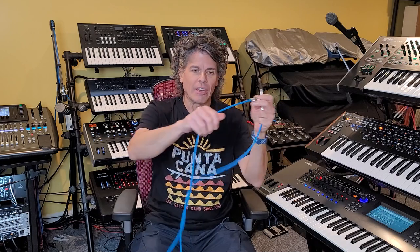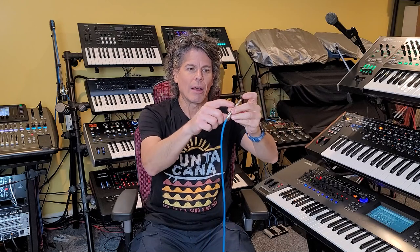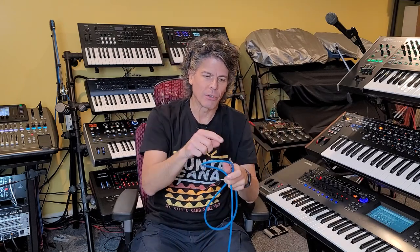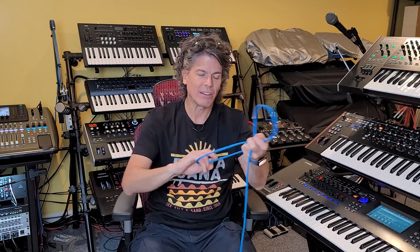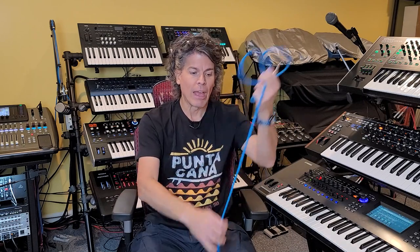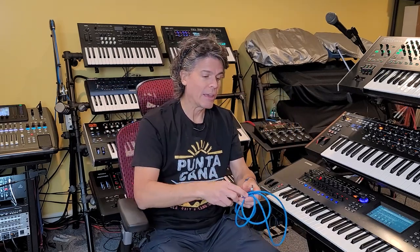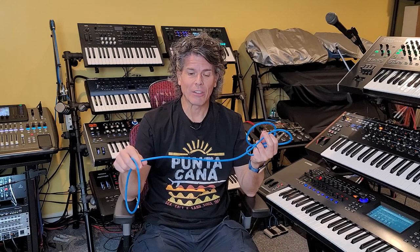As an added bonus, the cable itself is actually shielded. It uses that ground and wraps it around the outside of the cable, so the center conductor in the middle — which carries the signal — is protected from outside interference by that shield. That way, if we have a power cable lying close to it that might induce noise into the cable, the shielding helps reject that.